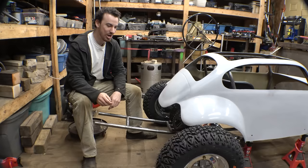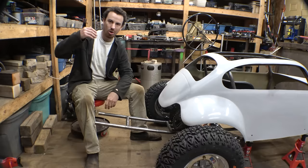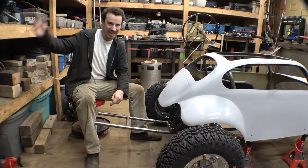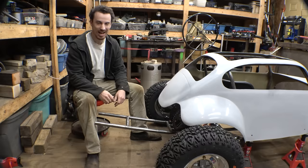Now, like I said earlier, I wish I thought of this before building the spool for the CV axles and everything. Normally I don't build a differential in most of my off-road vehicles, because for an off-road vehicle that's on loose traction surfaces 96 or 97% of the time, you don't need a differential. And actually having a differential makes it a little bit more challenging off-road, because then it's slipping and all, you guys know that. But yeah, that's why I normally don't do a differential.